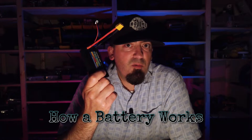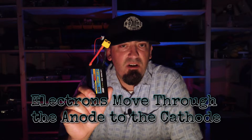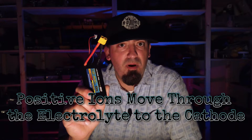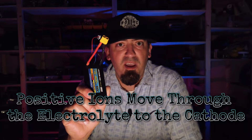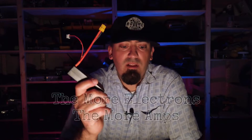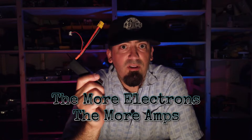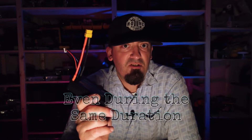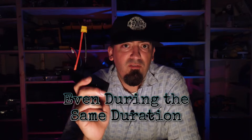So how exactly does this battery work? You have an anode, a cathode, and an electrolyte barrier between the two. When you discharge the battery, those electrons go from the anode — the negative side — into the positive side, to the cathode. At the same time, your positively charged units of energy transfer through the electrolyte from the anode into the cathode. The electrons travel through the negative battery cable, through the ESC, and return through the positive back into the cathode. A higher-capacity battery means more electrons can flow through that circuit, which means more amperage — regardless of how long you pull the trigger.